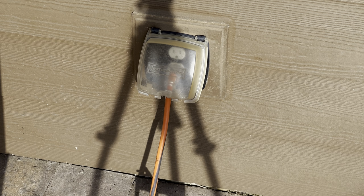Also, be sure you have a heavy-duty extension cable that's rated for outdoor use. That's important. Also, be sure your outlet is GFCI protected because you're working around water. You can buy a portable GFCI protection unit, and I'll put a link to one of those in the description. But a lot of outdoor plugs are already GFCI protected.